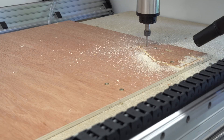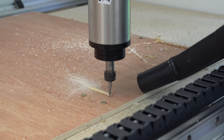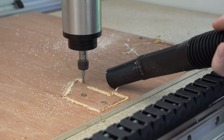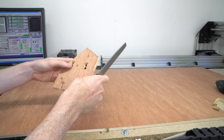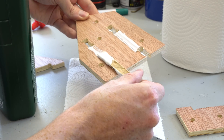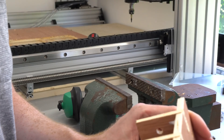I forgot to check the screw placement properly, so that router bit was ruined - but luckily I had a spare so I carried on cutting. I'm still learning about CNC feeds and speeds, so the edges are a bit rough, but nothing a file can't fix. I then added some glue and forced the parts together and they fit pretty well, so it was time to cut the rest of the parts.